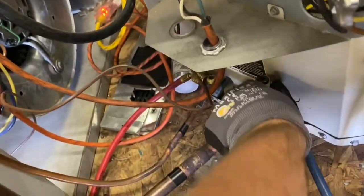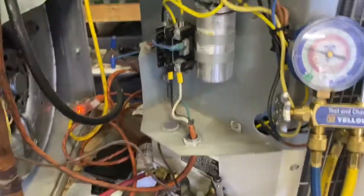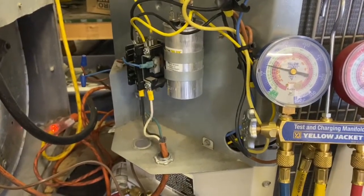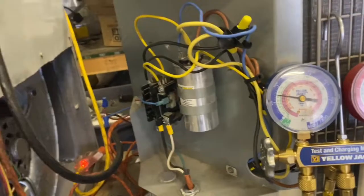You'll get frustrated. So what I'll do is close it all the way down and then open it up a few turns. You can see I'm having to go down a lot to get to the bottom. So we'll keep going, and don't worry, you'll feel it stop. So I've got to be getting close. There we go. See, that would take forever. So now I'll just open it up a few turns, flip it back. Now, like I said, you could just push in the contactor, watch it go down, and be done with it. That's not the safest method, nor is it the better method.